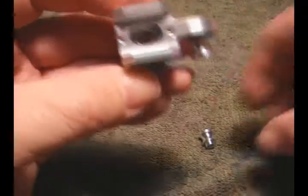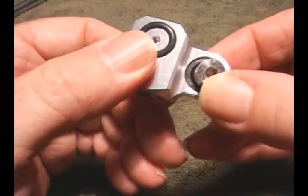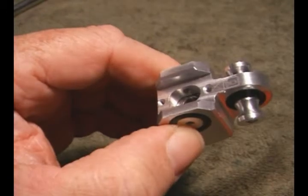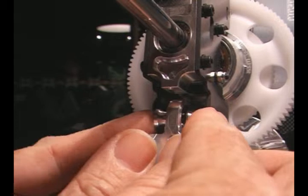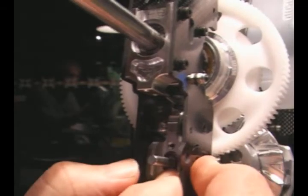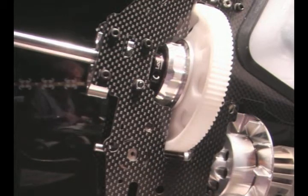So we're pushing our formers from either side. You've got to put them in squarely because there's no real tolerance there at all. And if you're interested, the markings on this are Ico manufacturer, made in Japan, and it's got the markings there, GE6E, whatever that is, but for those bearing fans amongst you, you can look that up yourself. Next up, we've got to take our clutch block assembly, with the oil logo pointing towards the top, and slide that over the starter shaft, and then just get these dampers flush between the sides, and then you can push that fully home until you see the mounting holes and the damper holes lining up with the cutouts in the carbon frame.